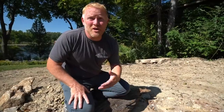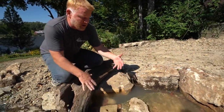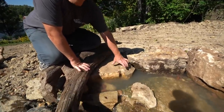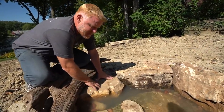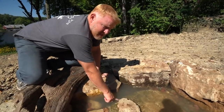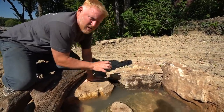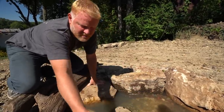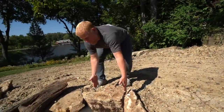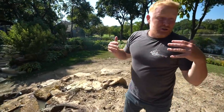The other part I really like is what the guys did to disguise the spillway. It really has this kind of natural spring area where water is just pooling up out of the ground. But underneath this rock is our waterfall spillway — we're using that 22-inch waterfall spillway. We've got this rock sitting on top, the spillway is all the way down here at the bottom of my hand. Water comes in, sits considerably lower than this, pools up — you can see how the water is just kind of pooling up right here giving it that natural spring effect before it spills over the waterfall. Such a better way than putting that spillway right at the surface where it becomes a focal point and is harder to hide.